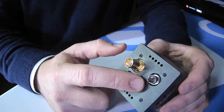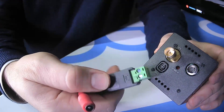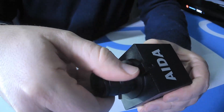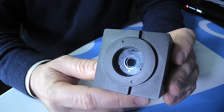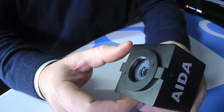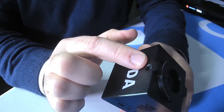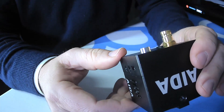Over here is the connector for the pigtail cable, which brings in power, control, and RS-485. We can use this to navigate through the menu. This is our RS-485 connector, so we can wire that up for control, and then this is for power. The camera has a sensor which is 1/2.5 inches — a little bit bigger than a 1/3 inch chip and a little bit smaller than a half inch chip — which is a great size for such a small form factor camera at such an affordable price point. It also has mounting holes on both sides, so you can under-mount it or put it on your tripod, whatever works best for your production.